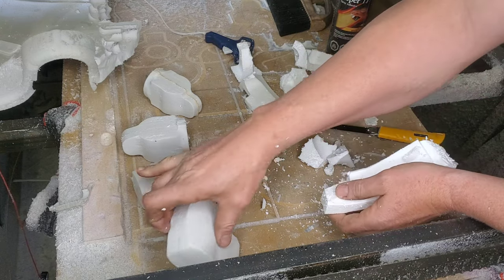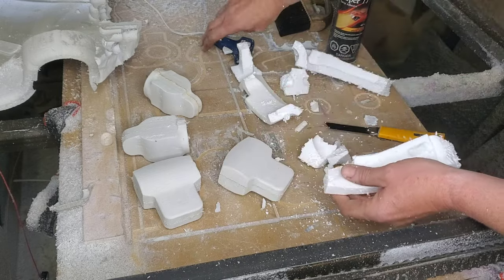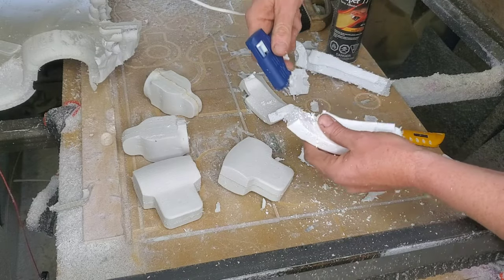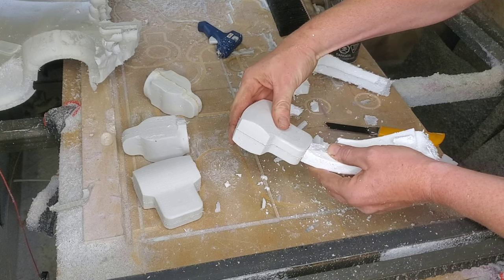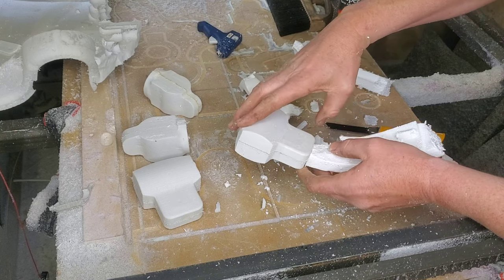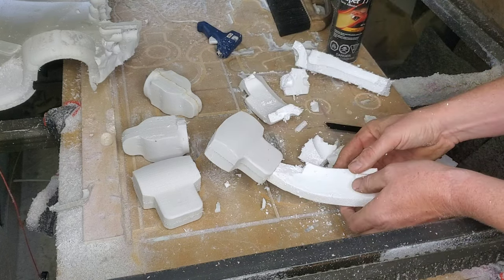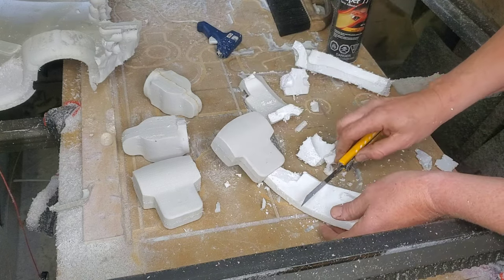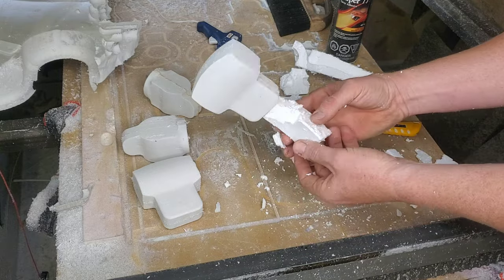One of the things I've learned over time is if you make the sprue a little bit narrower where it goes in, this is going to make it easier to part it off with the bandsaw. I'm actually making two separate parts — one for my motorcycle friend down the road and one I'm keeping in my shop, not only for balancing and truing cranks but also to balance my small surface grinder wheel, which is going to be useful for getting really good surface finishes.